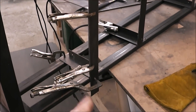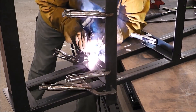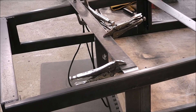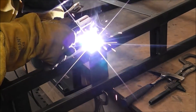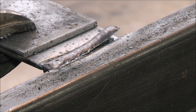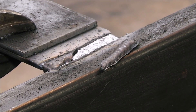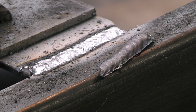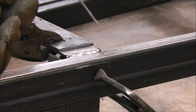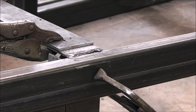Here's a look at that strong back on the back side — it'll come off after we're done welding. That's just to ensure this little leg doesn't get warped while we're welding. One of the really important steps for a quality-looking weld is body positioning — making sure you're actually comfortable and can feed in the wire properly with your hand to keep it consistent. I bumped the amperage up 8 amps — I'm at 28 amps now. You'll find that some of your best welds are when you're comfortable, relaxed, and at ease, feeding the rod in and metering it in well.